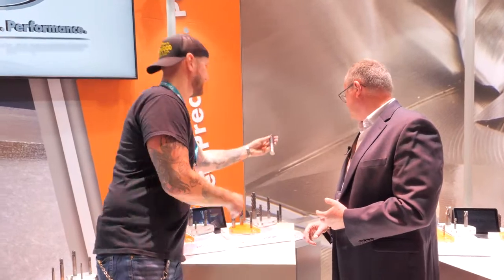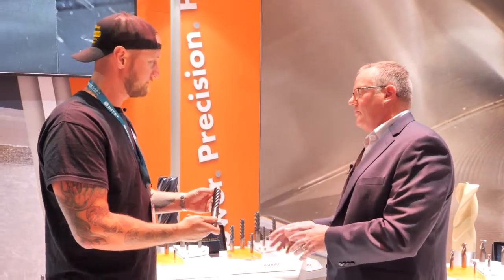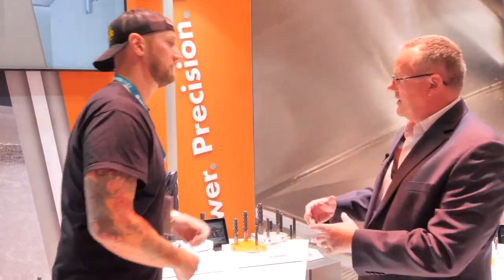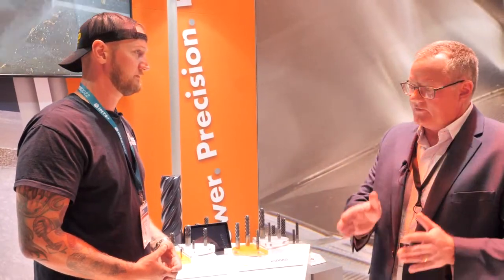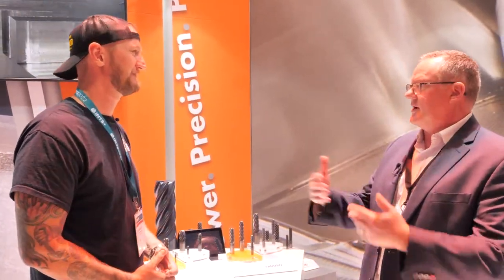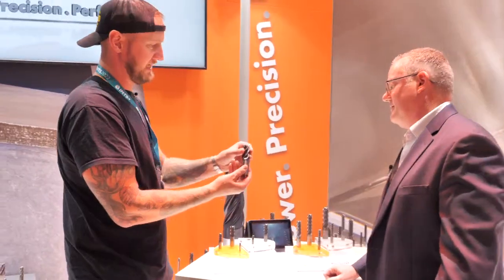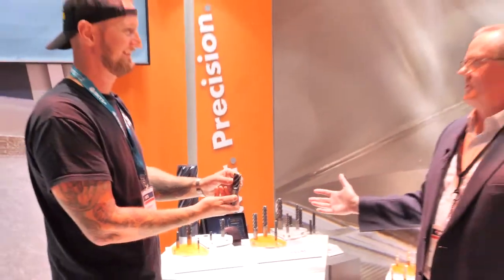For these — seven versus five flute — is this just for higher powered machines? Actually the 7-flute adds a little extra dimension and will require a little more power than the 5-flute, but they're very closely related in geometry and will simply allow for a higher metal removal rate. The beauty of all these tools is that because they have a thicker core and features found in the high multi-flute tools, it's a nice transition from traditional toolpaths to high efficiency machining toolpaths. The job shop can buy these and program them both ways. These do come with radii — we do a lot in the aerospace industry so we have to have all the radii available.